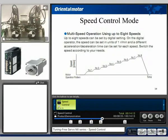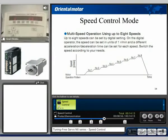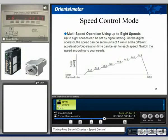Right now, I have the motor running and set to the internal potentiometer. So I can simply adjust the speed by dialing up or down this potentiometer. I also have the OPX set up to display output speed. So right now, the motor is running at about 2,600 RPM.